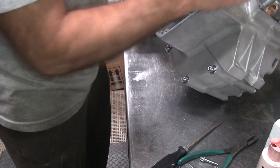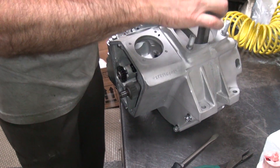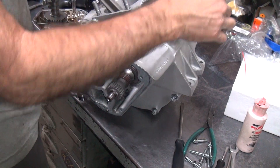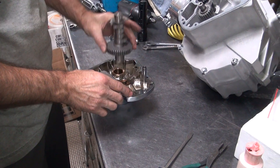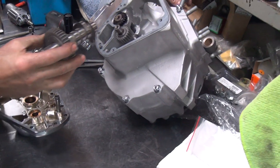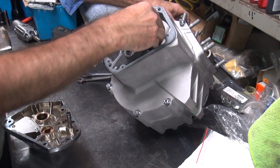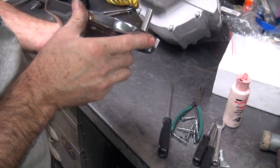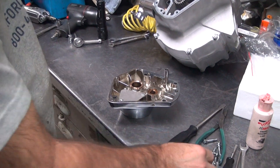So I'll go back to my original theory - there's a misalignment between this cover and where the crank is. It turns nice now, see - the crank's spinning nice and straight. So you know it's not that. That means I get to go do a line boring job. Even though it looks good, something's not right. I'm going to do a line boring job and I'll be back.